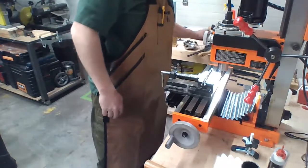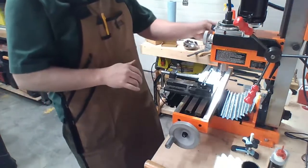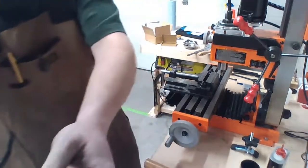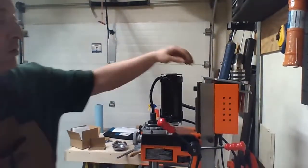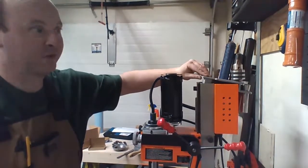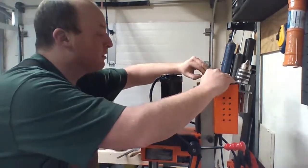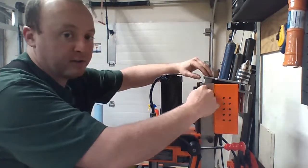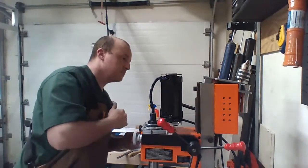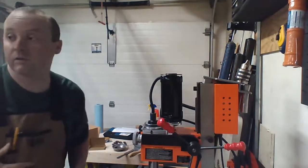I want to try to clear up this. So this is done. Safety, power off. The biggest thing right now is, I call it the holder. It's 3D printed and it's just sitting in there. As it runs, it picks up and almost falls out. So I'm going to measure that, put a 1/4-inch bolt right underneath here, and drill it straight into the side to hold it in. It's all drilled and tapped already, so I'm going to do that.